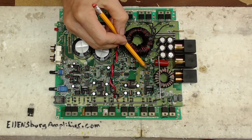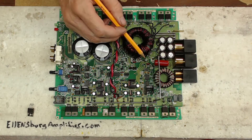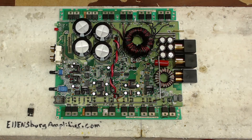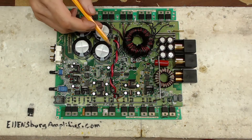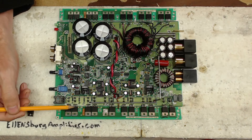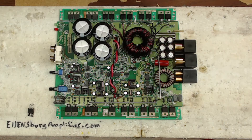I removed U11 off the board and then reapplied my 12 volts to build rail voltage, and lo and behold the transformer — the whole board itself ran just fine. You can start this board up without U11 in. That's the IC that creates your carrier and your synchronization signal going back to U16, the clock for your power supply. With U11 out, I would show positive voltage on the gates, which I'd expect because your latch pulls these high without that carrier signal.